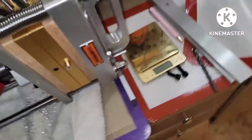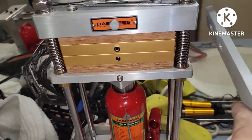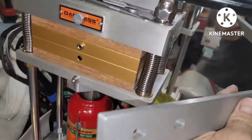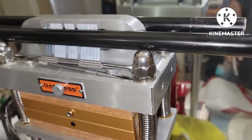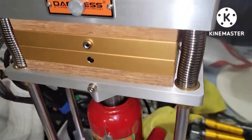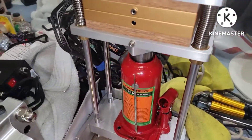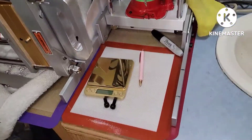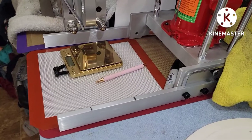What I did was I took the legs that they give you — they go up here and extend it so you can lay it on its back and drip. I took them off and I'll show you mine. You take them and you drill new holes and you put them on like this. You tap and die those in the side.